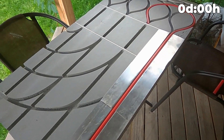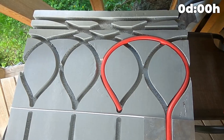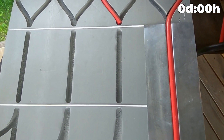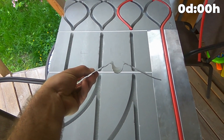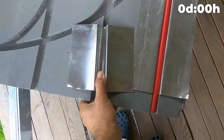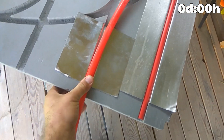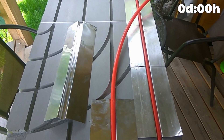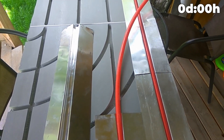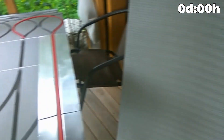The XPS has milled grooves and the system uses typical modules. On the example of this exhibition sample, I will show you what the system consists of. There are several types in the standard system core modules: swivel, straight sections, and manifold approach module. Also included in the system are heat distribution plates, which have a special shape for best heat dissipation. These plates fit easily into grooves. A pipe with a diameter of 16 millimeters is laid into these plates — the pipe fits simply and is securely fixed. The system comes in several standard plate sizes, pre-cut aluminum of different lengths: 500, 300, and 115 millimeters long. They come in bundles, and the 0.8 millimeter aluminum thickness makes it easy to trim if necessary.